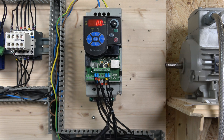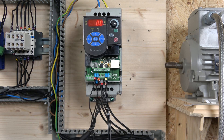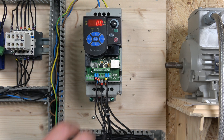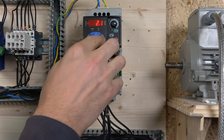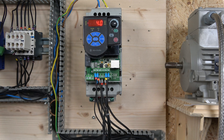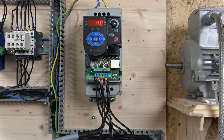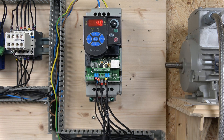With the drive in run mode at 2 kHz carrier frequency, the noise is terrible. However, the switches work less hard, which prolongs the drive's life. Then as you change it back, by default you're at 4 kHz, which Allen Bradley recommends. At 4 kHz carrier frequency the noise is noticeably better. That gives you a good idea of what carrier frequency does — it's there for you to play with and adjust to your needs.